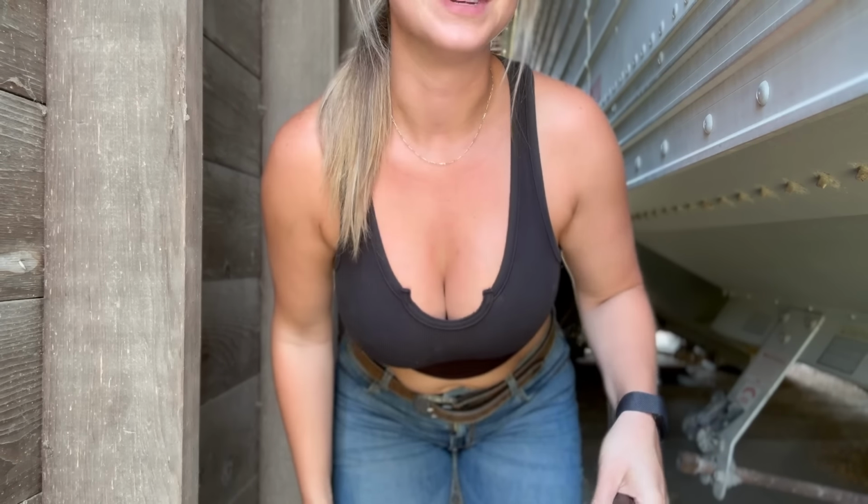I'm gonna open up the back trap to show you how sticky it is. And if you're unfamiliar with how grain trailers work, this grain trailer has two traps underneath it. These traps are basically just two gears that walk along and open from the bottom, because when you get to the elevator, you dump from below the trailer. I think if I show a video of me dumping at the elevator, you'll see what I'm talking about. But this back one is giving me some issues.